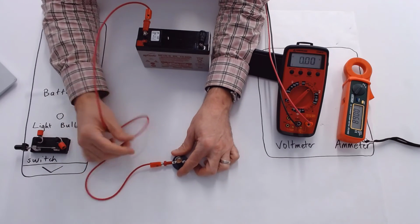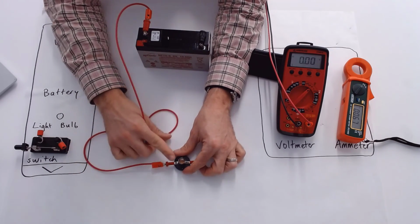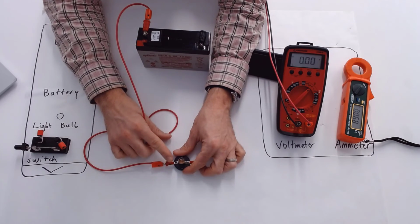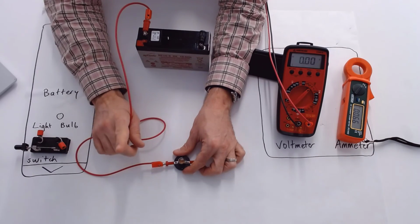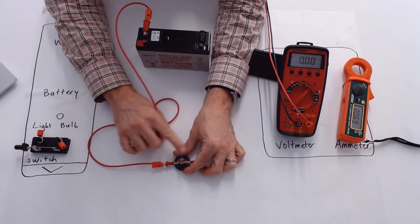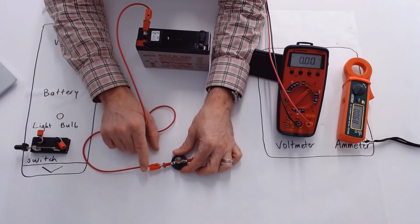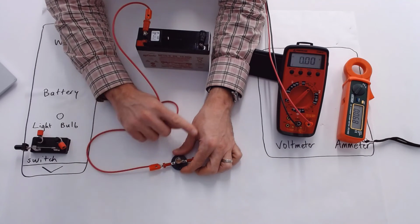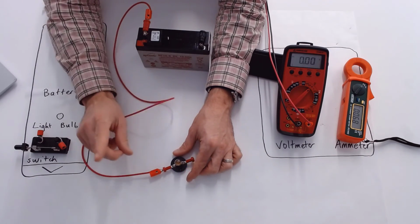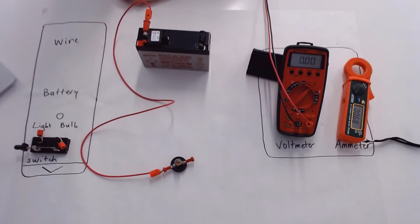It's hooked up. So this is plus volts. So this should be charging this bulb. And in fact, it is charging this bulb to positive charge. But that's not what makes a light bulb glow. What makes a light bulb glow and for power to be dissipating, this 3 watts of power, is you have to have current, electric current flowing through the bulb. And that is not happening. The only way to get current flowing is if you complete the circuit.